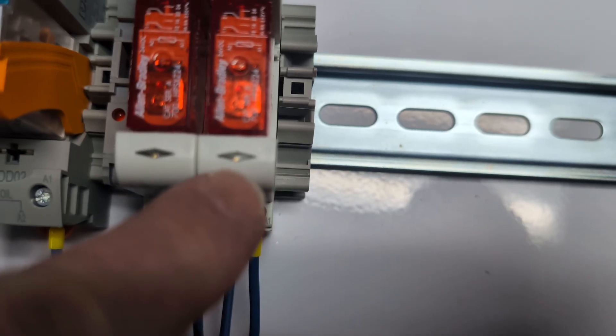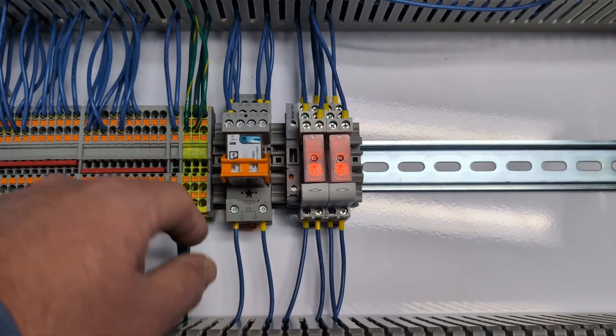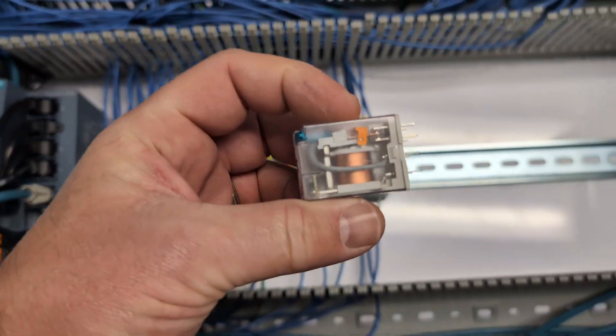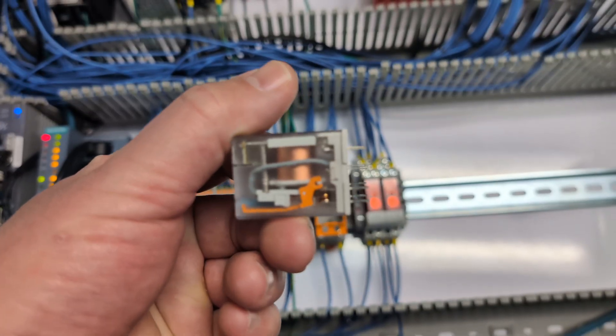Isn't that an interesting unplanned learning opportunity? It seems to run fine like that — I may just leave it that way to drive everybody slightly insane. But yeah, this relay during one of the exercises is bad. I wanted it as real life as possible. They can't pop this relay out and have it look perfectly new. I try to put them right in the situation where they feel like they're at the plant. I want them to pop this relay out and see the smoke, smell it, and be like, yeah, that thing's bad. I try to really get into all their senses to help them learn.